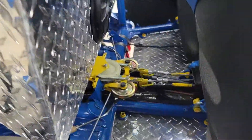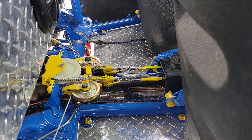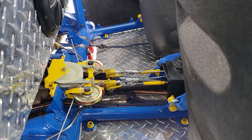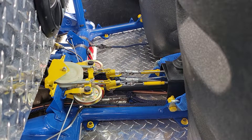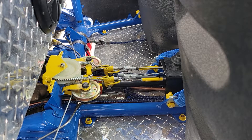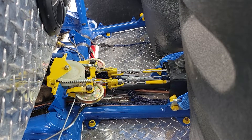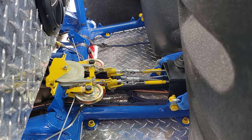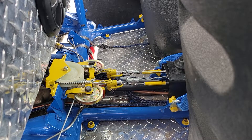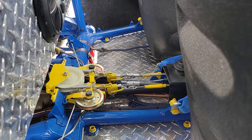Here you can see how the cutting brakes are installed. They have sliders for the emergency brake cables to be pulled tight. If you pull on either handle, it will independently grab on whichever cable, which gets redirected through the pulleys down at the bottom — the silver pulleys. It goes to the side you want to apply brakes to. That white pulley is a spring that maintains tension against the handles so they're not flopping around while bouncing down the road. You can pull one handle and it puts more tension against the other handle while also distributing tension back through that pulley.